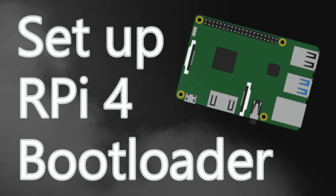The second and final step is to configure the bootloader of your Raspberry Pi to boot from USB. On a Raspberry Pi Model 4, this is really easy, as the bootloader is configured by default to boot from USB. However, if your Raspberry Pi is running an older firmware version, or if you changed the configuration of the bootloader, then here are two methods for how you can configure your Raspberry Pi to boot from USB.